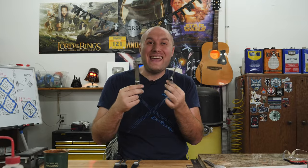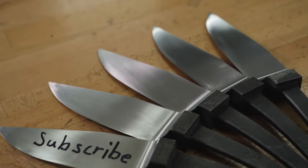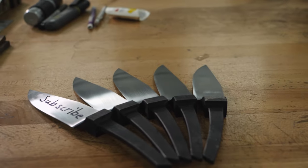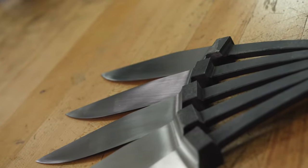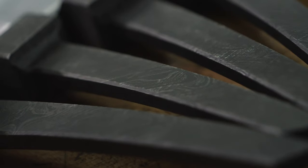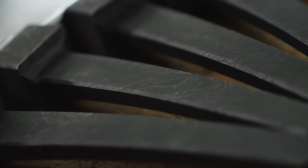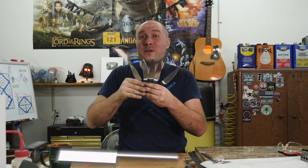I just got all five of these sanded to 320 grit — it took about half an hour per knife, so it wasn't too bad because they're pretty small and I already had them ground to 320 grit. In the next video we're going to continue on, get these clips ground in, get the spine cleaned up, start working on the bolster some more, and get these things ready for handles. These are also going to be available for purchase, so if you don't want to miss out go follow me on Instagram and I'll be posting them up when they're done.